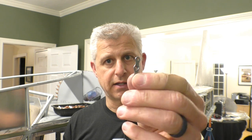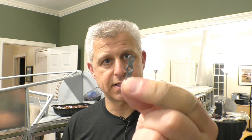The last step in getting the gas cap mounted for a fuselage center tank is to be able to actually mount the screws that are actually going to hold it. Now, in order to do that, we take the cap assembly that we've got here and we have to put these nut plates on. These nut plates just have little wings on them that get rivets that just hold the nut plate in place. That's going to get put on the back of this nylon and riveted through using soft aluminum rivets. And then I made this trim ring, and the trim ring here, you can see, has all the holes, gives a little more support to the outside, but it also allows me to use countersunk screws that will be flush.